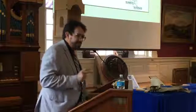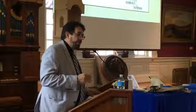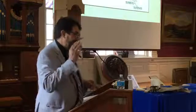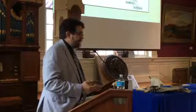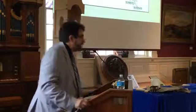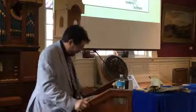So when you put this in the ammoniated cleaners that a lot of these clockmakers are doing today, the wheels' teeth will fall off, there'll be splits and cracks, maybe not right away, but the fissures have started, and the bell hitting, the gears grinding every day, it could only be a matter of years. So I want to stress to you all that when you're having your clocks done, you make sure that your person is not using ammoniated cleaners.